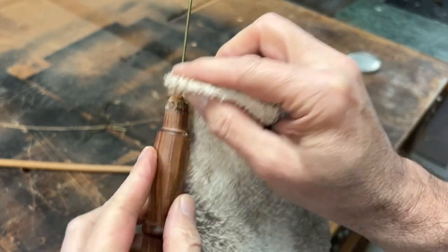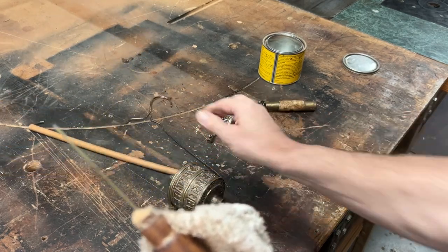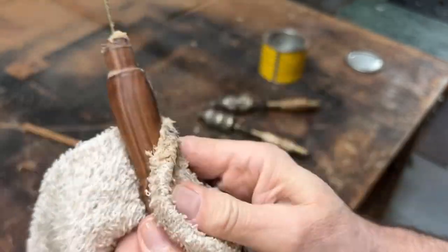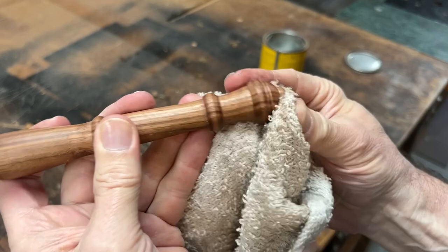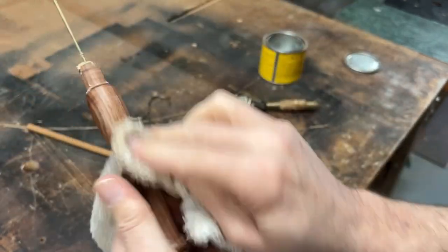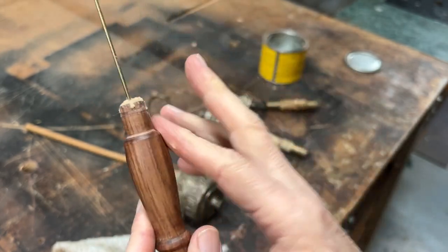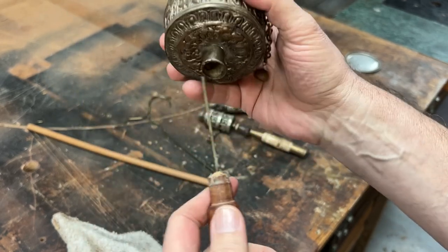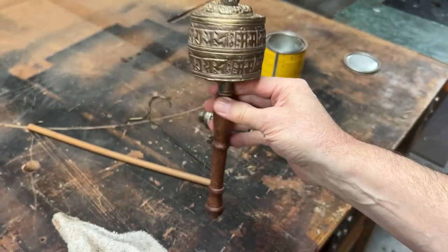I'm applying some Minwax Finishing Wax to this. You see the wire — I just cut it out of a piece of coat hanger, and I think that'll be fine. I'm spreading the wax around, filling everything, and it's looking good. I like the end — I think that turned out well. I trimmed it with a knife after I took it off the lathe, just carved that little end with a small carving knife. I'm not going to worry about too much wax up here because I think it'll just aid it. Now here's the top — I just had to measure to find the center hole so that it's correct.